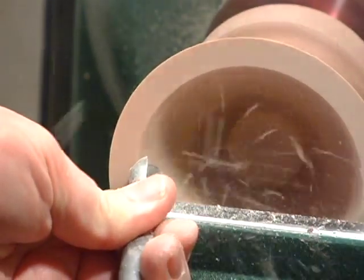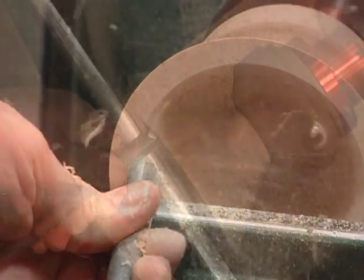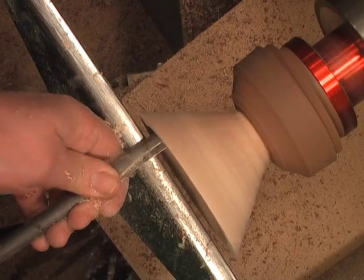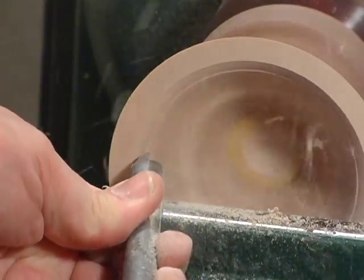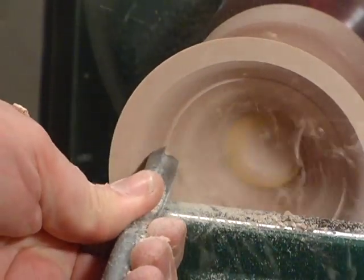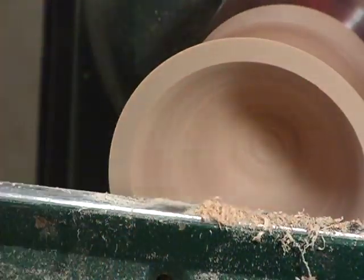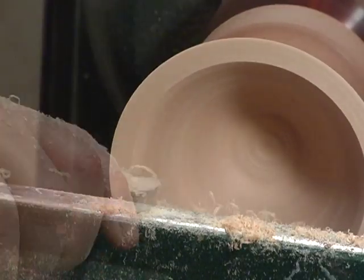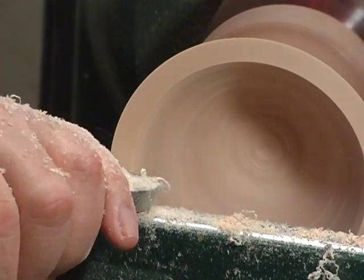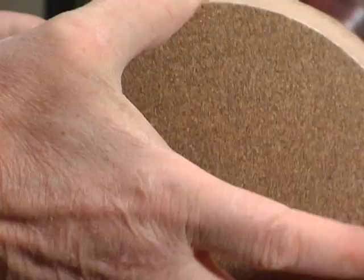And it's my habit whenever I have a chance to go in the inside, true it up as well, remove all those bandsaw marks, and make things round. This is just preliminary wood removal. Only remove wood you know you don't need. Now that leading surface, that has to be obviously flattened as well. Same process. A few scraping passes, the pencil marks, applying the sandpaper ever so briefly.